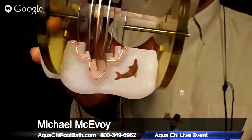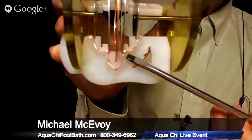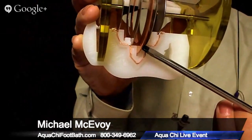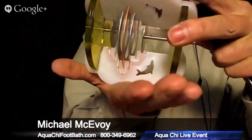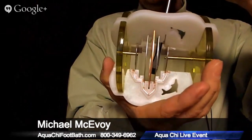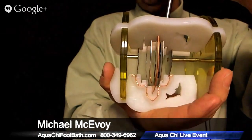I don't know if you're going to be able to see this on the video, but you see how the silver rings on either side of the copper ring, they have to seat fully into that copper strip. Okay, they're not. So what I do is hold the module with this sitting flat on a table, and then put a flathead screwdriver in, and you're going to push down. You're going to use quite a bit of pressure for this. I'm going to do it.